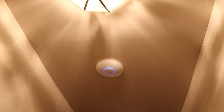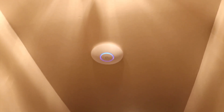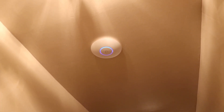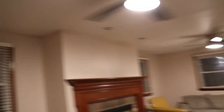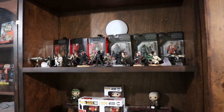For the wireless access points, I put one on each floor. The second-floor unit is situated right in the middle of the hallway between all the bedrooms so everyone gets good coverage up there. One thing I really like about these Ubiquiti access points is they look like a smoke detector — they're not obtrusive and most people won't even notice them. Moving down to the first floor, the access point is in the corner of the living room next to the kitchen, where most people will be using Wi-Fi on that floor.